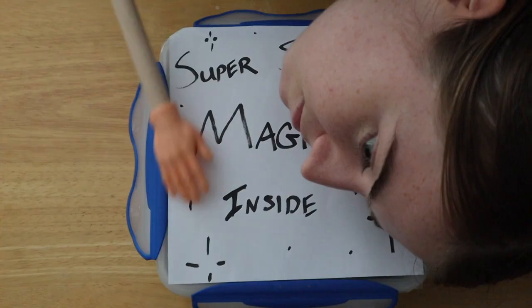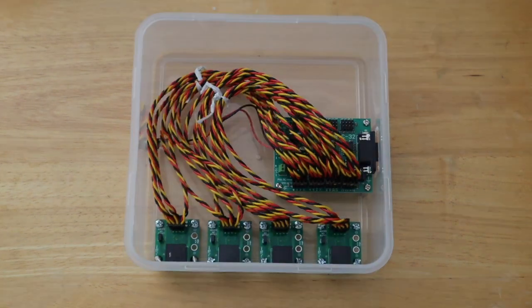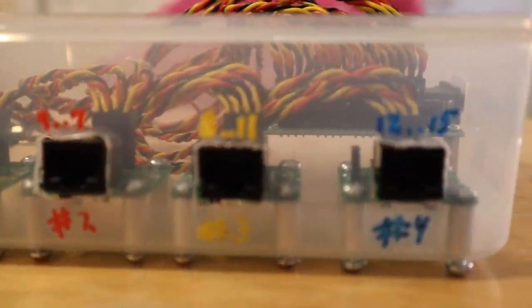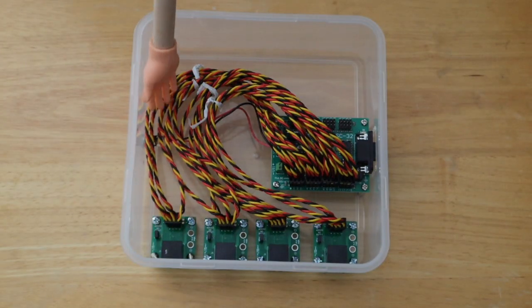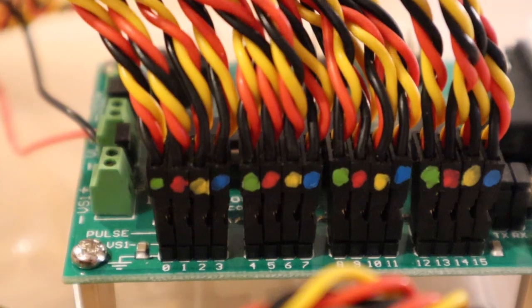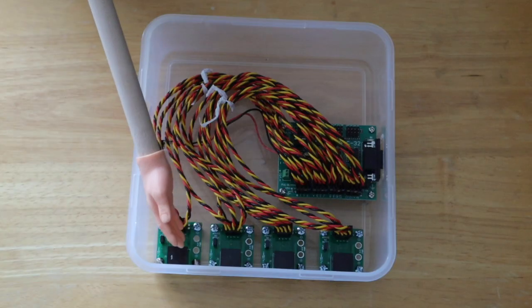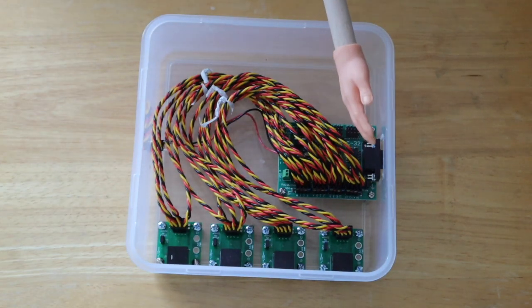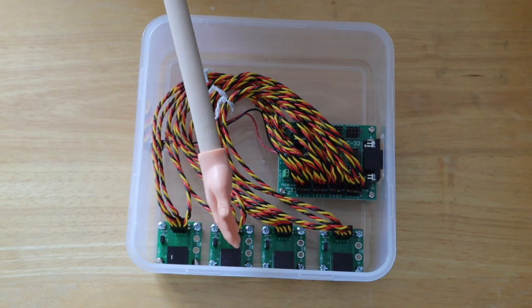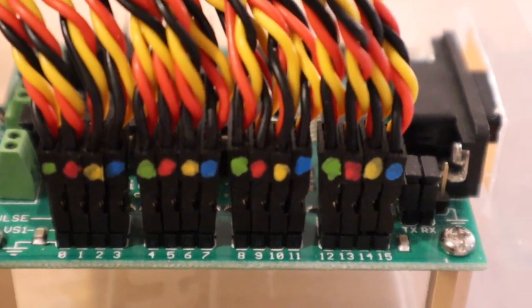And I know you're all dying to know — what's inside the box? Well ladies and gentlemen, I present to you the great, the mighty, the one, the only — the SSC-32. We have four sending boards for four pirates, but we could actually have four more on this side because as the name implies, the SSC-32 can handle 32 servos, and they're all hooked up using servo cables. The first sending board is wired to the first four pins of the SSC-32, and the second board is wired to the next four pins. So if the jaw on Captain is connected to the first pin on the receiving board and he's plugged into the first sending board, it'll be hooked up to pin 0 on the SSC-32. And the next pirate's jaw, if it's hooked up to pin one on his receiving board, it'll actually translate to pin four on the SSC-32, because his sending board is hooked up to the next four pins.